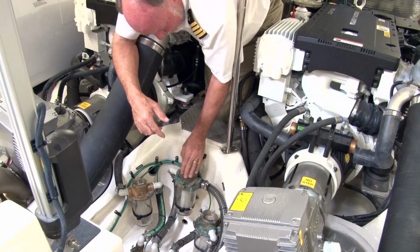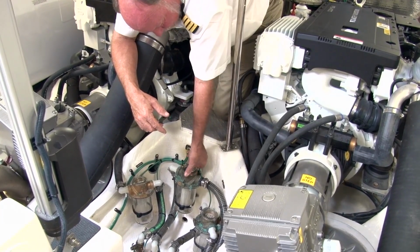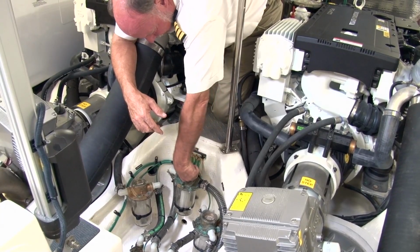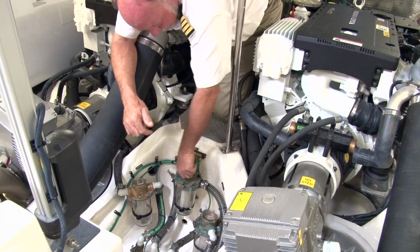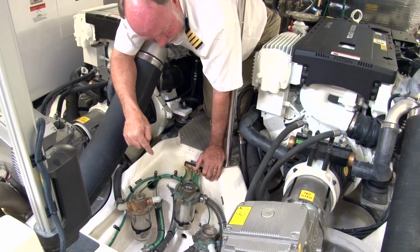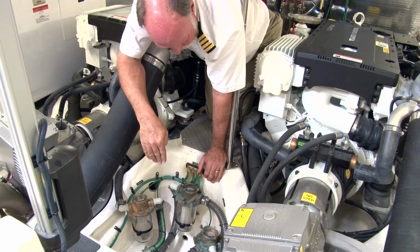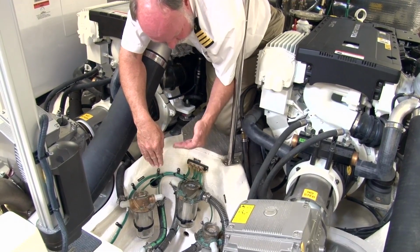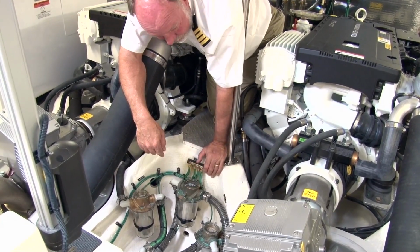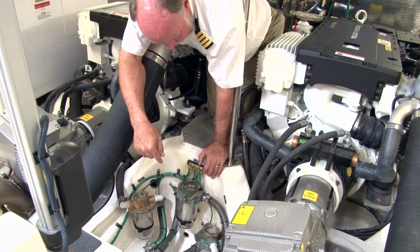The O-ring is actually what does the sealing, so you don't need to reef down on this thing real hard. You know, it says hand tight right on the top, so just tighten her down. Then what you're going to want to do is open the seacock again and then check to see if you have any leaks. You can do that easily. Although you can't see underneath, you can see the water dripping in the water that's already in the bilge, which will give you an indication of a leak.